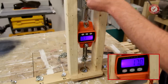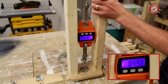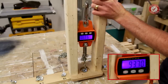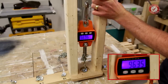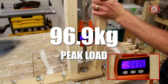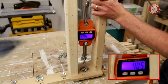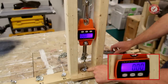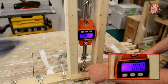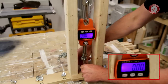Can we breach 100 kilos? Not quite — it's just giving way... there it goes. Definitely went past 90. Impressive — I would expect it. There's a bigger surface area of thread on these screws. We got past 90 kilos — not bad going.